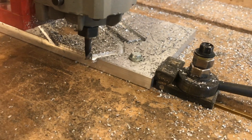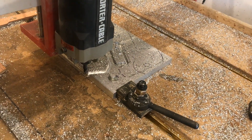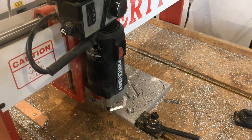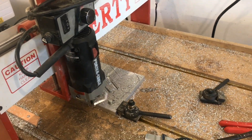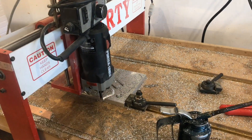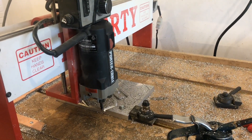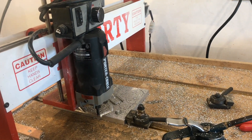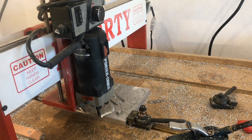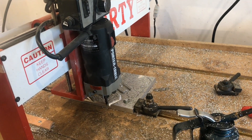The other thing that might make a difference is the coating on your end mill. The two common coatings are titanium nitride, which is the gold-ish color you see on a lot of drill bits, and titanium aluminum nitride, which is a darker, almost gray color. Ironically, titanium aluminum nitride is supposed to work well on every material except aluminum — and I'm actually using it on aluminum. But to be honest, it's been working okay, so probably titanium nitride might be slightly better, but it must not be that big of a deal.